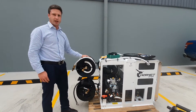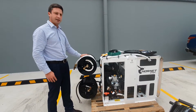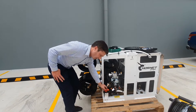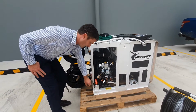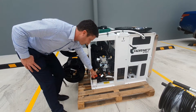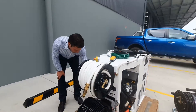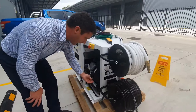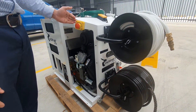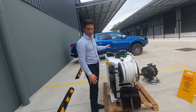To start the machine, before you start you must always make sure you've got a full tank of water. Run the garden feed reel out to your garden tap, turn it on, and make sure your valve is in the inline position — not off, and definitely not on drain or you'll drain the tank as you're trying to fill it. Make sure your throttle is set at about half or just above half, and your e-stop must be out for the machine to start. Water in, water on, full tank of water.